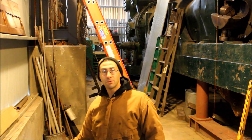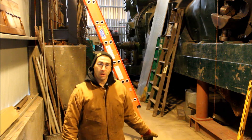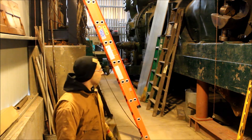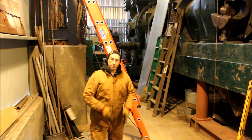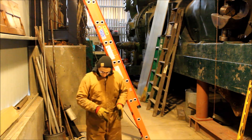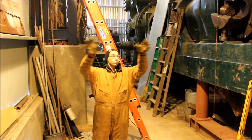Now using that information, that will help me determine where this pillow block has to go in here. It'll come out so the center line of that will be about right here. And then the gearbox will sit here and the motor will sit about right here.